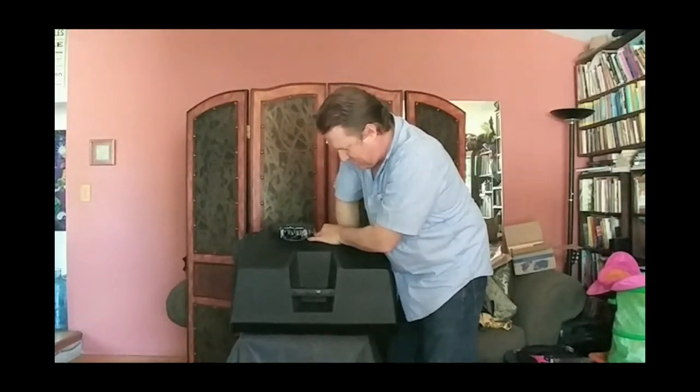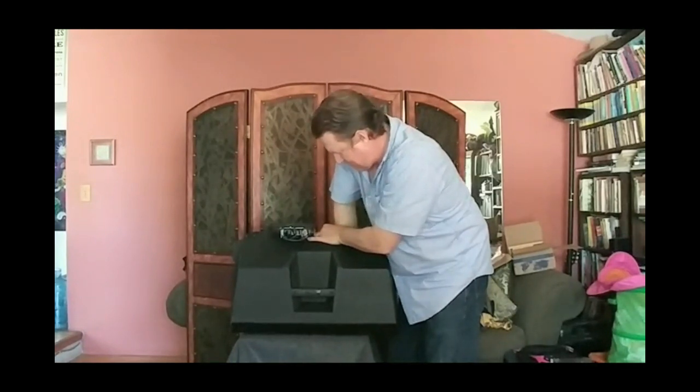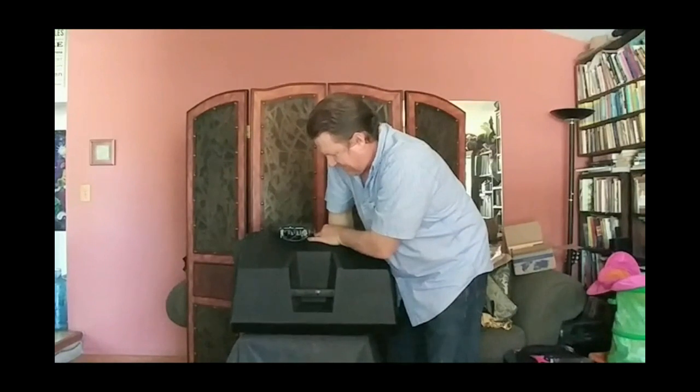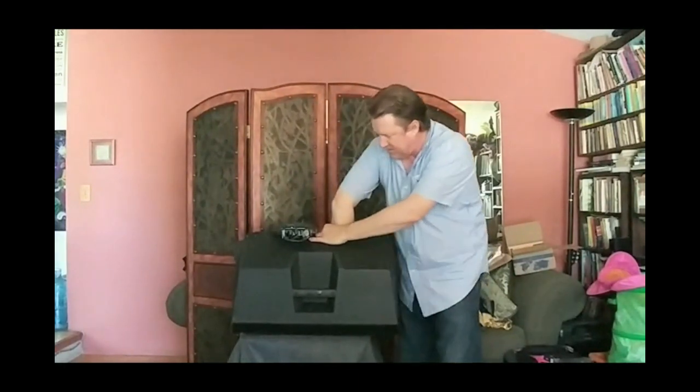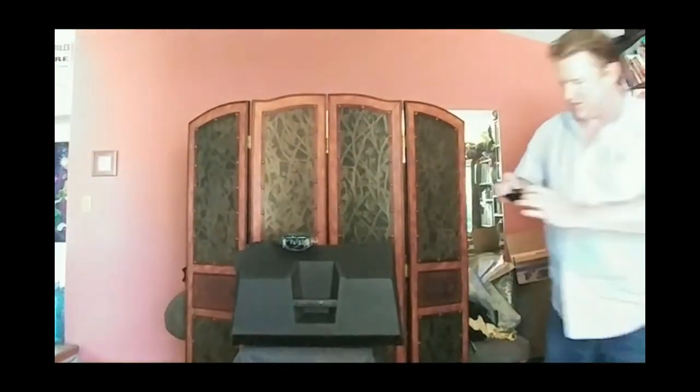I'm screwing the new tweeter right back down into the horn handle, turning clockwise until it's nice and firmly seated. Now I'll show you inside — there it is. We need to hook the wires back up to it: there's a wide one and a narrow one. The wide one goes on the red terminal, and the narrow one goes on the narrow terminal. Now we've got to put the heat sink back on this one.